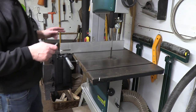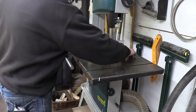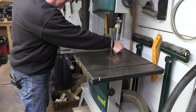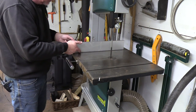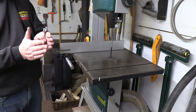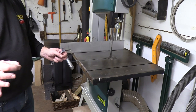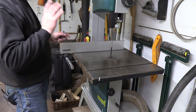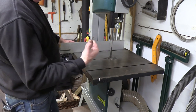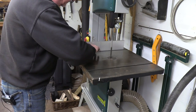If anything, you could do with a slight negative on this side. Just a slight. If you put your nail across there, you can just feel the edge of the T-slot. And here it's lost, so it's all parallel all the way through. And all that's doing really is, it's telling you the fence is on a slight negative from the saw blade. But fractional, very, very small amount. You know in your own mind then where it is. What you don't want is it on the other way. You never get a square cut off it at all.